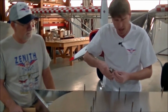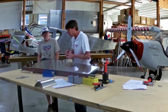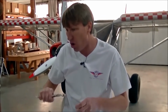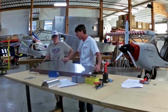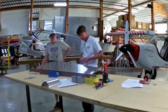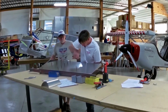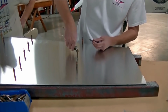Now this is a critical time. Even though it's all matched hole, you need to make sure you still have it on its beams and still have the block. You could actually cleco all the holes and still get a twist. So you just want to verify that everything is set properly. I've seen customers, they'll have their skeleton like this. You just need to make sure that everything is still sitting properly on your table and on the beams. It's going together really nice. It's very quick.